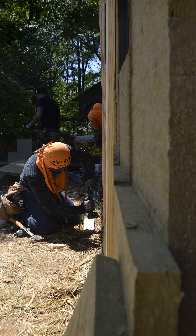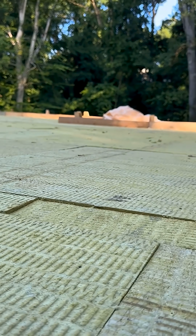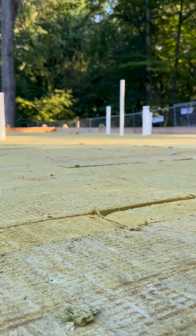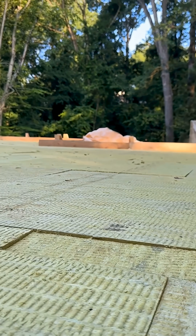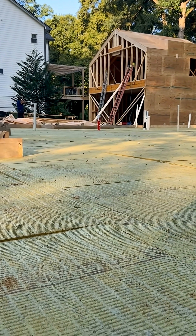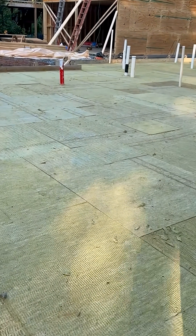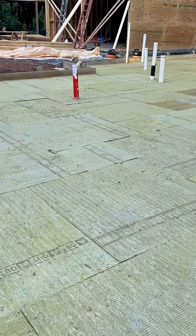This is our form board — that's our two inches of insulation there. It runs perfectly flat all around the footprint of the building. The only thing they had to trim around were these pipes. Right there, the red one that you see right about here, that is our radon pipe. That's going to take our radon or our soil gases up through the roof.